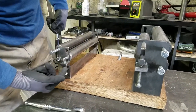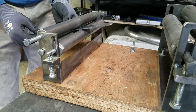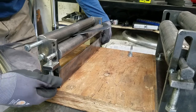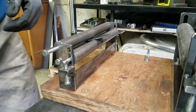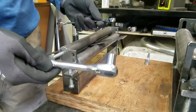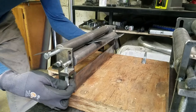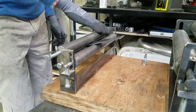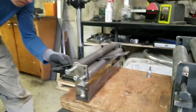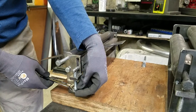To begin, you'll have to lower the adjuster bolts most of the way down, and then you can put your workpiece in. Then you can begin to tighten the adjuster bolts. For this smaller model you will need a 9/16 wrench — it works better if it's the ratcheting type or a regular ratchet. Snug up your adjuster bolts and visualize them so that they're even, then tighten moderately snug.